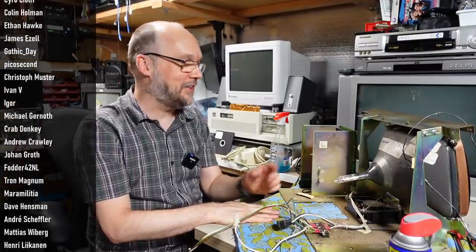Anyhow, that's it for my Septandi video on the Model 2. If you liked it, thumbs up. If you have experience with these machines or can recommend software to use if this thing ever does work, let me know - I actually have some blank 8-inch disks, so it's quite possible I could hook the drive up to a PC and image a downloaded image onto an 8-inch disk, or I could wire in a GoTek as well. I think GoTeks can hook up to an 8-inch drive, though there's some extra signaling that maybe the GoTek can't emulate - I'll have to read up on that. Thanks to my patrons whose names are scrolling up the screen - if you want to be a patron you can do so at the link below. Stay healthy, stay safe, and I'll see you next time.